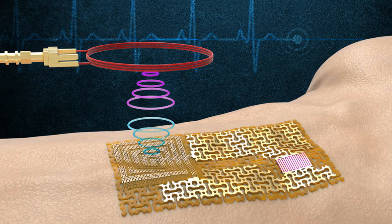The research group previously developed a technique called remote epitaxy, which they employed to quickly grow and peel away ultra-thin, high-quality semiconductors from wafers coated with graphene. Using this technique, they fabricated and explored various flexible, multifunctional electronic films. In their new study, the engineers used the same technique to peel away ultra-thin, single-crystalline films of gallium nitride. The team used a pure film of gallium nitride as both a sensor and a wireless communicator of surface acoustic waves — essentially vibrations across the film.